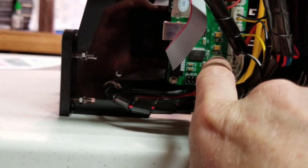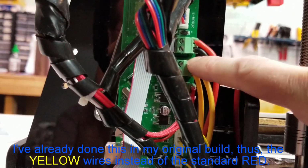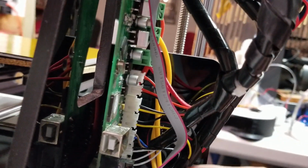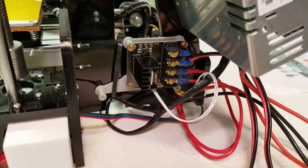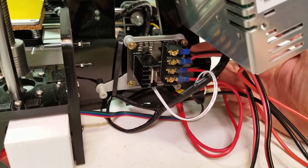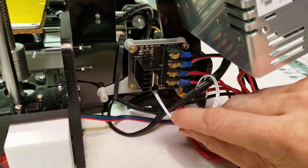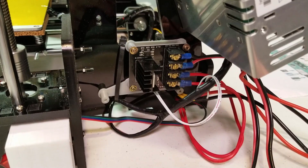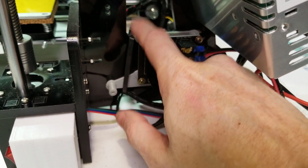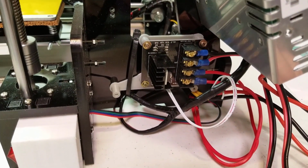Here is where we will plug in our thermistor, and here is where the heat bed is plugged in. After installing the 4 ring terminals onto the power supply and onto the heat bed, we can then proceed to plug in the thermistor as I showed you in the diagram. I'm using a 3D printed bracket that I found on Thingiverse, and this will actually be shown in the description below.